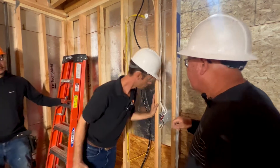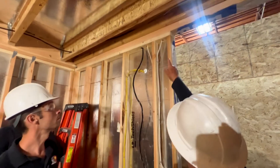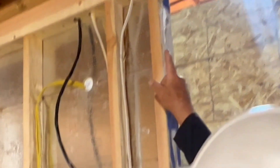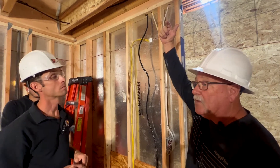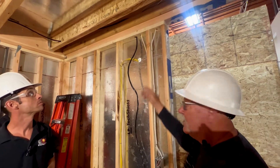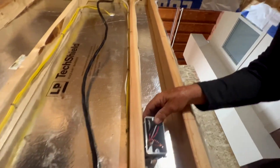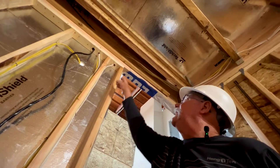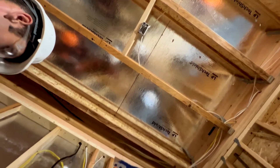Right here, you've got holes that are punched where they knocked the clip out — anything we knocked out, we have to fire caulk. We also have to fire caulk where the top wire goes through up, because a spark can come through that hole and get into your roof system. Any fire that starts in your electrical boxes travels up and gets into your roof system through that hole.